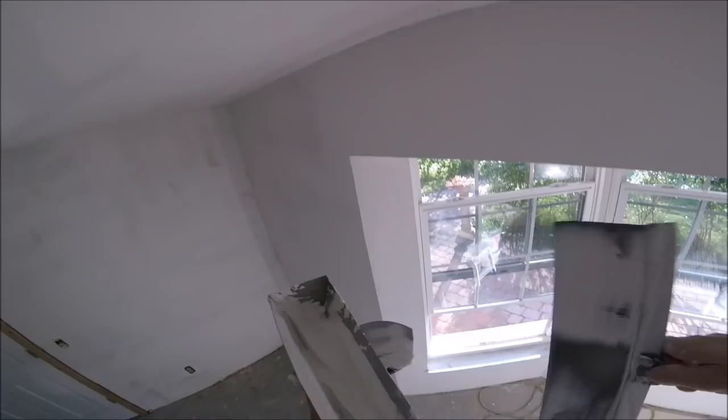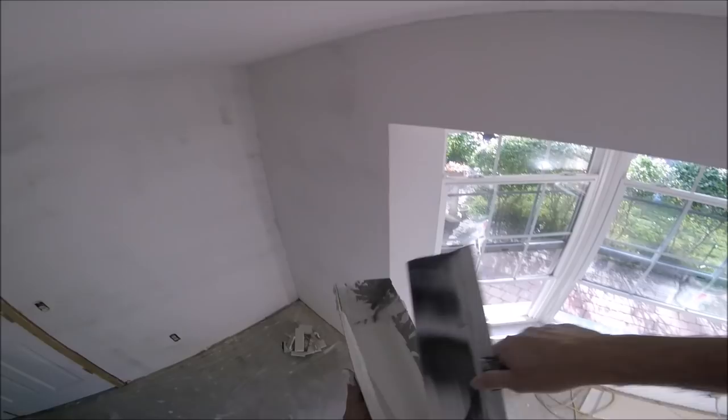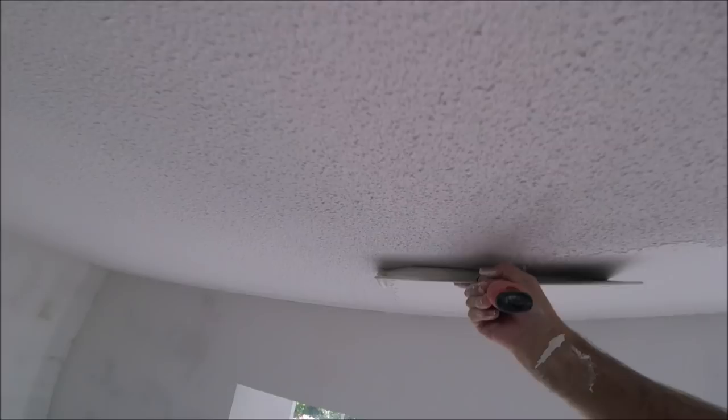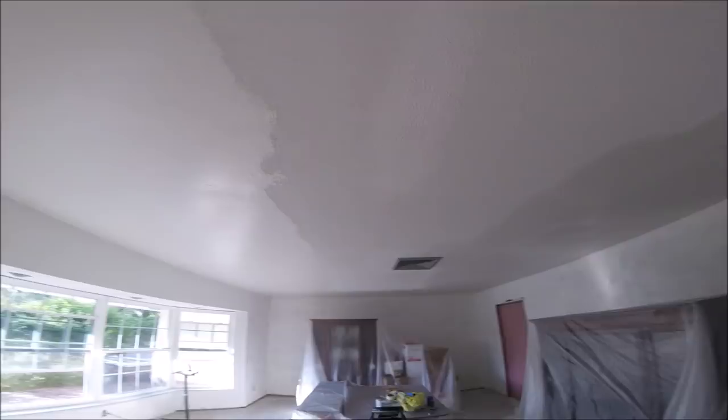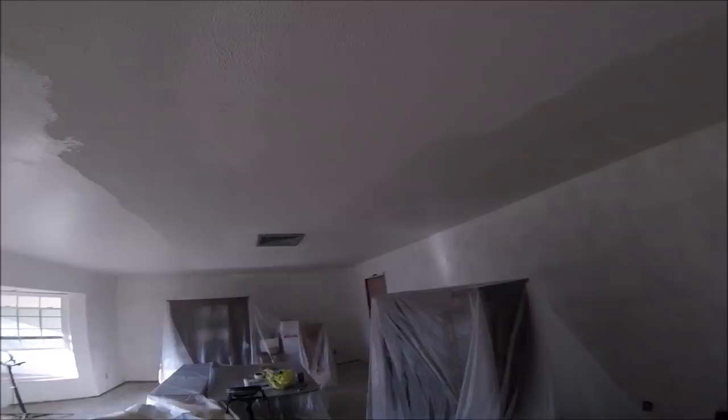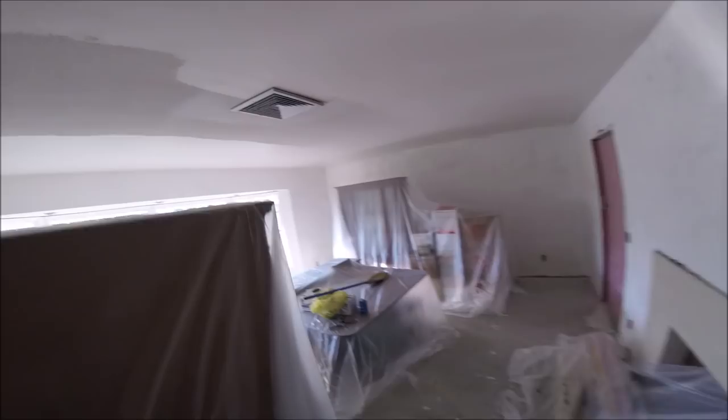Here is the second section — I'm wearing my GoPro to get up close so you can see exactly what I'm doing, how I'm placing the mud and how I'm pulling. It's a pretty heavy popcorn. Just placement of the mud and no lines — that's what you're shooting for. Stay tuned for that video. Here is the second section I skim coated; the center is not done. I did both sides, and coming up in the next video I'll show you the whole process on the second section. As you can see, it's coming together pretty quick, and this is a huge room.